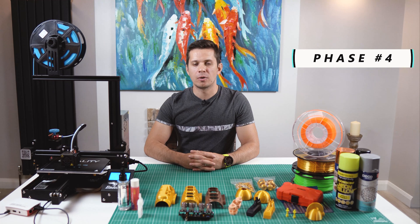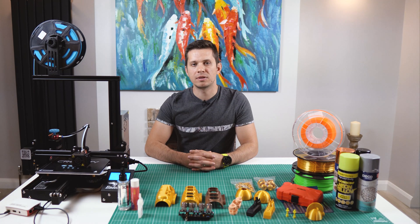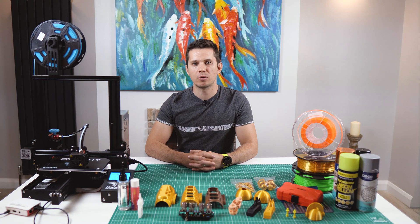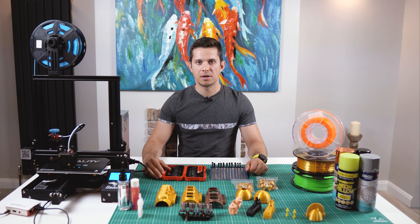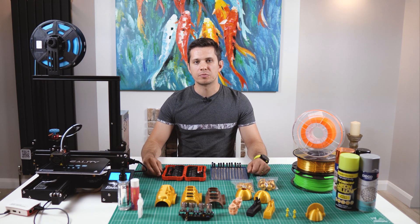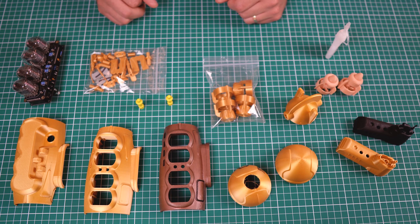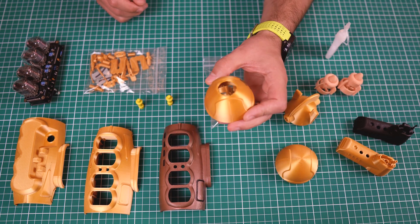Final phase — this is where we validate all our hard work. Will it work or will it go bust? Word of caution: whenever you work with PLA or 3D parts in general, make sure you handle them with care. Don't force the parts together. Make sure they have been cleaned from all spurs or leftovers from using supports. Should you encounter a slight resistance, use a needle file and gently file the part until the assembly fits snug. I've been using these two tools for years for post-processing and they've worked a treat, and they're quite inexpensive. I think we've done enough talking — there was a little bit of trial and error, and I had a few parts which have been painted or post-processed, or even failed prints as you can see.